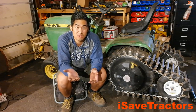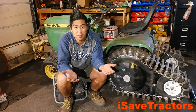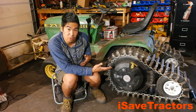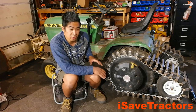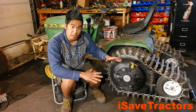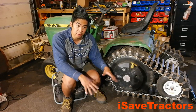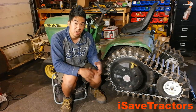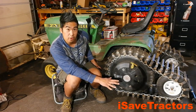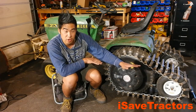First, I'd like to take a moment to answer some of the most frequently asked questions about this half-track build. The first one was: why put tracks on a lawn mower? In theory, having a track system will lower ground pressure and help spread out the load so you don't spin your tires out as quickly. The whole idea of a half-track is to spread and distribute the weight everywhere so we don't spin. By not spinning the tracks, I can apply more of the engine's torque from the wheels to the ground. When you spin your tires or a track, you effectively lose all traction and all capability of creating work. By spreading the load out and having each grouser plate making equal contact with the ground, I'm able to more efficiently use the tractor's power to go forward.